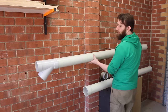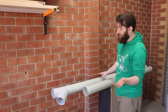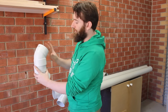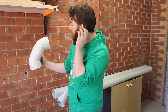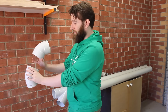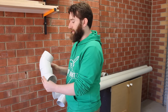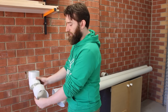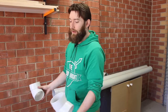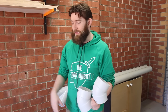This piece and a Y fitting will go about there. The Y fittings and all the other fittings I just got from Bunnings, but you could get them from any plumbing supply place. Then we'll be going down onto the floor using two 45-degree elbows to make a gentler curve. I'll need to cut a filler piece so it will connect. It's 100mm PVC pipe. Then I'll do the same transitioning to the floor so it can run along as hard pipe rather than flex pipe to the bandsaw, table saw, and router table. I'll get a three-way connector eventually — I've got a two-way for now — and I'll put in blast gates along the way.